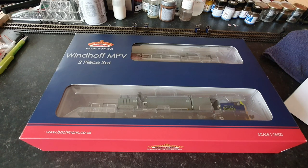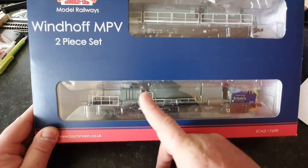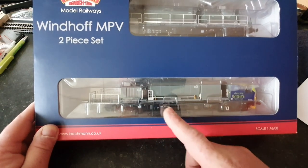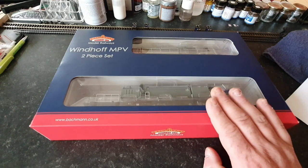The units entered service in 1998 and up until now, the present day, in the UK, under Railtrack, and after the takeover of Network Rail, these guys are now branded in Network Rail livery. These units, being a multi-purpose vehicle, can be used for anything that the railway system requires, as each unit has a flatbed wagon and can have containers put onto and secured down by the locking system from an ISO standard container. All these components are interchangeable, held on by the four locking nuts you would see on normal intermodal containers — a quick and simple, easy change of the vehicle.